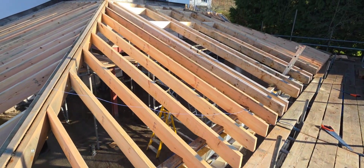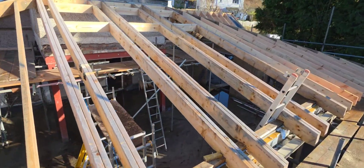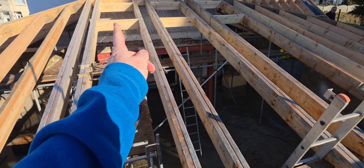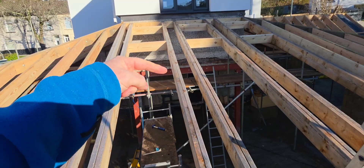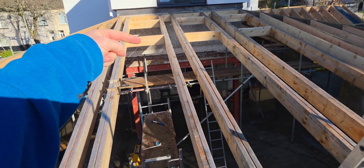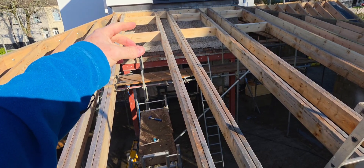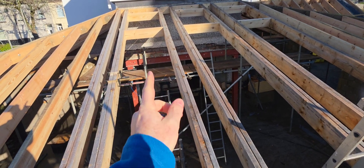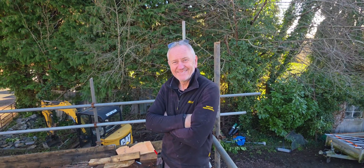Sorry, walking like a 90-year-old! He's got all his Velux windows in. The reason why he hasn't put this rafter in is so when we put the felt and batten on, the line of the batten will dictate where the window is going to go. We can move that piece of timber down or up to suit the batten for the tiles, and then once they get that set they can put this piece of timber in and nail it all up.